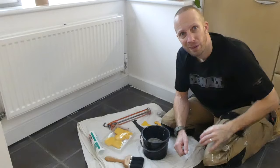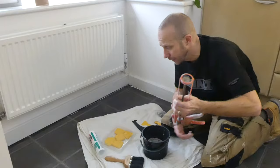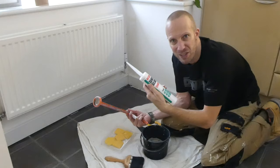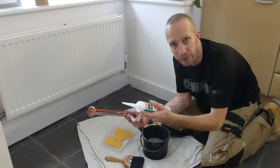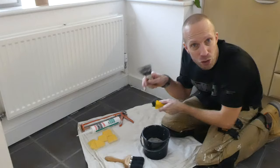Now, we don't need too many tools to sort this out, but the tools I'll be using today are of course a caulking gun, or silicone gun, whatever you want to call it, and some silicone. Do make sure it is silicone and don't use a caulk. Sanitary kitchen and bathroom silicone is what you need, because it's going to be waterproof and it's less likely to go mouldy. You will also need a set of finishing tools, and there'll be a link to this in the description box below.